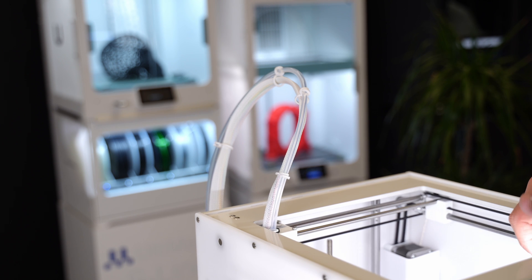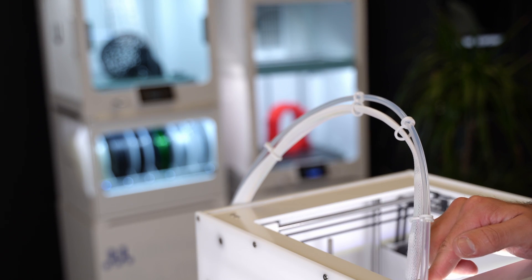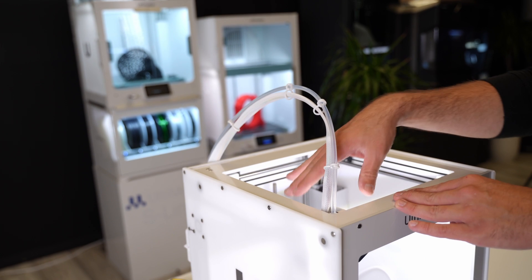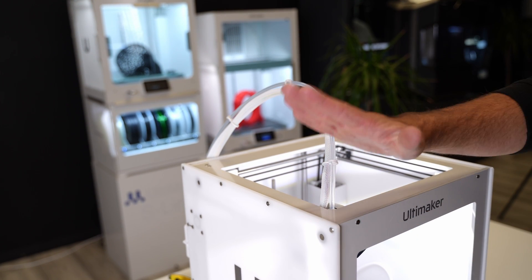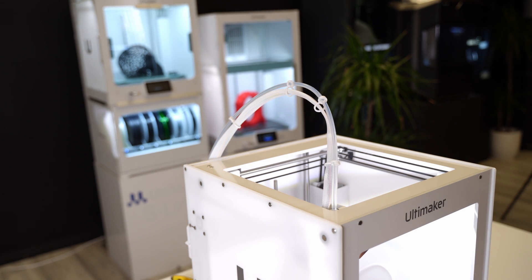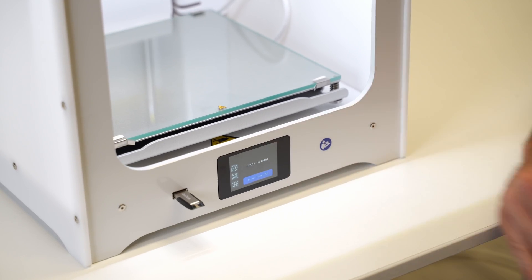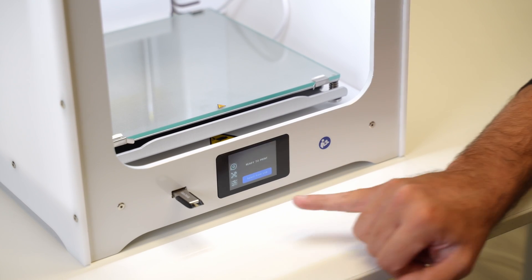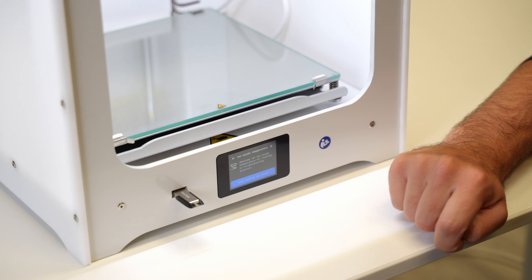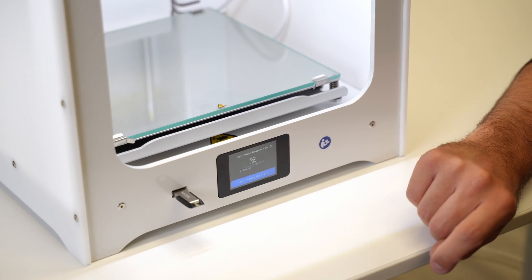The first thing is to move the printhead to the front corner of the machine. The main reason for this is so that we don't put any excess pressure on the axes bars and cause them to bow, which would cause issues with printing long term. Next, we're going to set the temperature on the screen by going into the maintenance menu — the second icon down — and setting the nozzle temperature to start heating the nozzle.